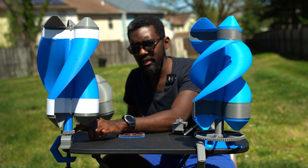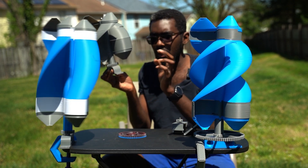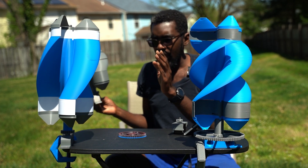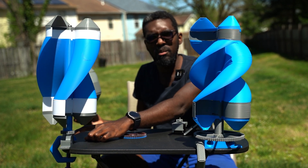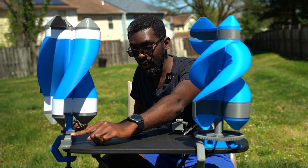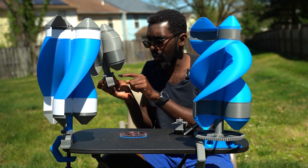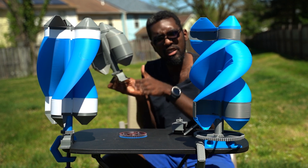If you don't have washers to put between your gear and your motor mount, I put tape. I didn't have washers this morning, but with free overnight delivery on Amazon I got washers. Before I had the washers, I put tape on the bottom of the gear and tape on top of the motor mount to reduce that friction.